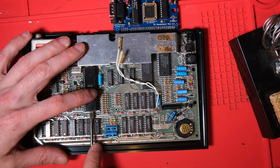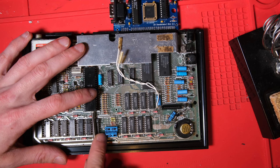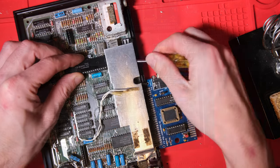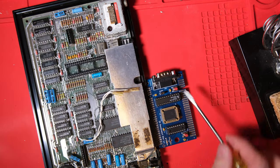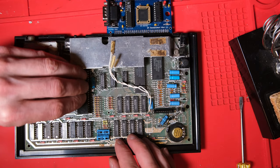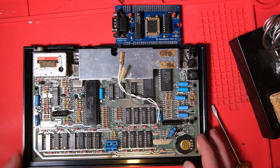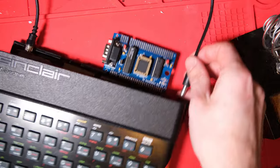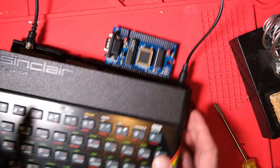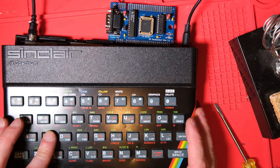First thing I'm going to check is the ULA. I don't think that's going to be the problem, because it's a 7 ULA, which is a good one, but I'll pull it out and pop in a known good replacement just to be sure. Cross your fingers here, because it would really suck to have a ULA with such a minor fault, and they're not cheap to replace. And yet there was still no audio, that's good.